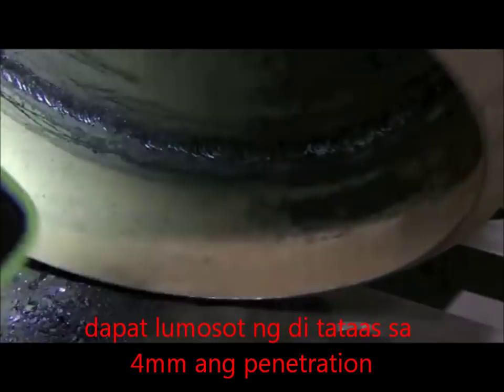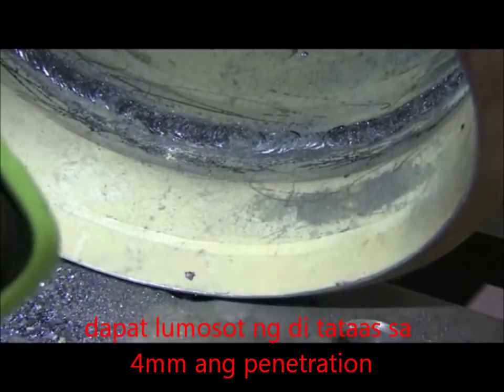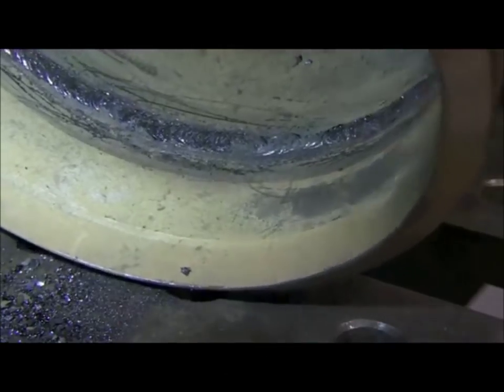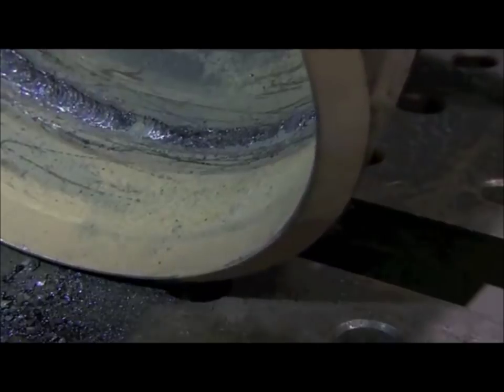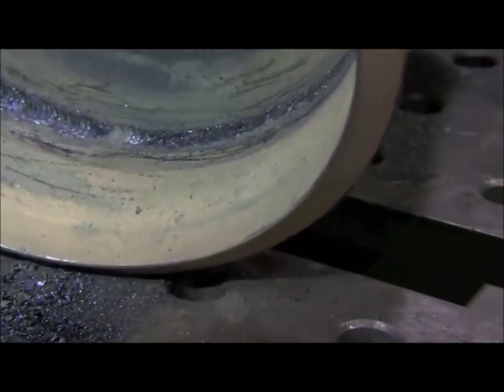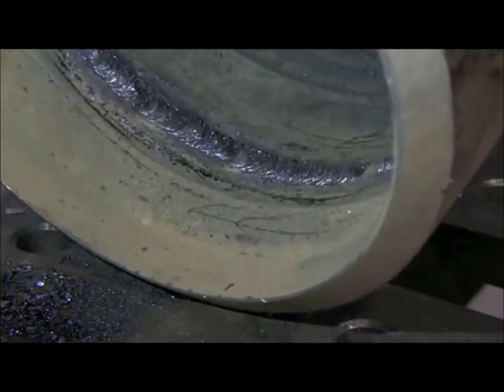Like you saw, it was a little hot in places, a little heavy, a little wide probably, but for the most part it went in pretty much okay. And hopefully it gives some help to somebody who's getting ready to take this test. I guess up next will be the 7018 fill and cap. That might take a couple of weeks to finally get around to doing all that.